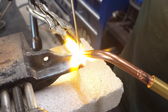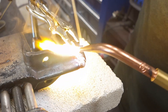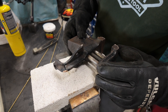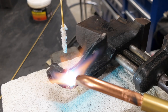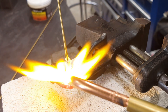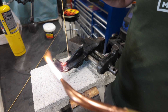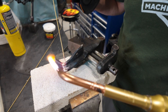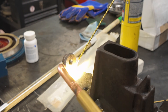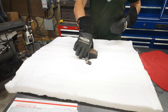You're going to hear a pop here in just a minute. That pop is basically me getting the filler material way too hot. I struggle — I swing between not putting enough heat into the part and putting way too much heat into the part. At the end of the day, I think it just comes down to practice. Brazing is definitely one of those skills that requires a bit of finesse. Being familiar with your torch, understanding how to choose the correct size tip for the job at hand — these things require an innate understanding of how things are going to go before you even turn on the gas, and that comes with practice and experience. In spite of making those beginner mistakes pretty much the entire time, I was able to finally get through it, work my way around the entire part, and finish up the repair on this vise.